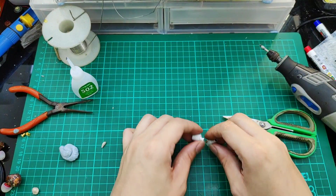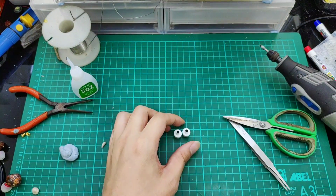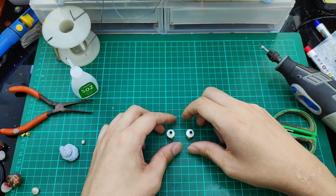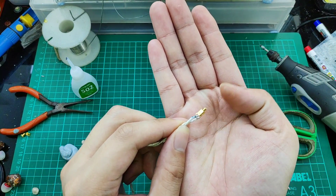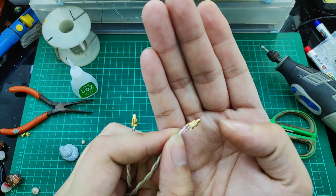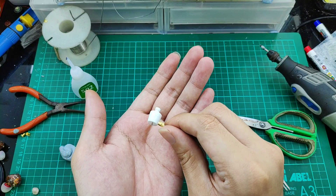When installing, we have to make sure the air vent of the driver is at the top, where the vent hole is. The mod is completed. Before two hours have passed, we do not recommend that you put in any form of cable to test it. But as we have shown before, you can use an MMCX connector with the locking ring removed — it doesn't click — to test if the drivers and everything are working properly.